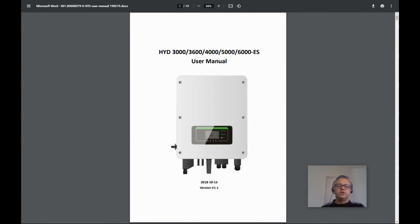of solar generation capacity. And then to choose the model of the inverter, if you want to minimize grid use, you will need to add the size of the average load you want to allow for, like 2,000 watts, to the battery charging rate, which was 2,880 watts. In this example, it would be 4,880 watts, so the 5,000 ES would be a good fit.